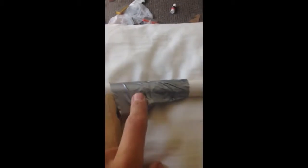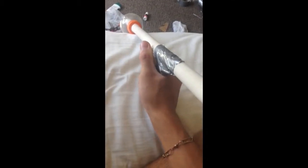There are a couple things I forgot to mention in the video. First thing: wrap the wires in tape and put hot glue on them — just make sure they're very well insulated. Because what happens is when you're holding it about to fire and you click, sometimes it shorts out to your hand and you just end up getting shocked.